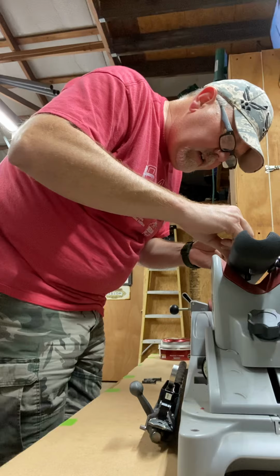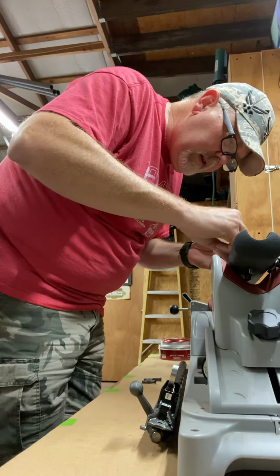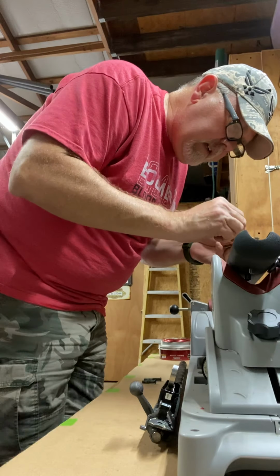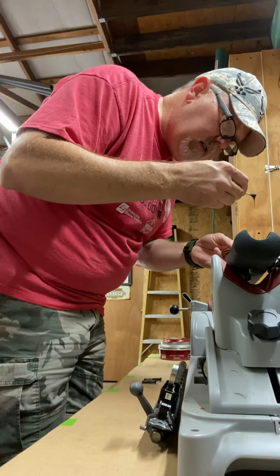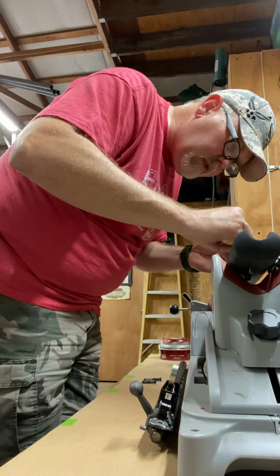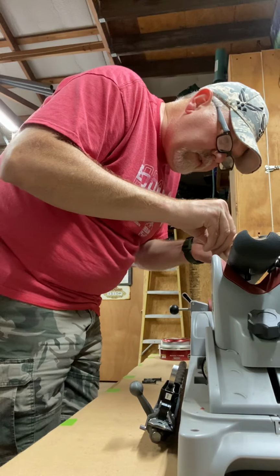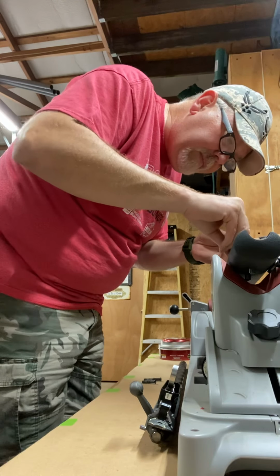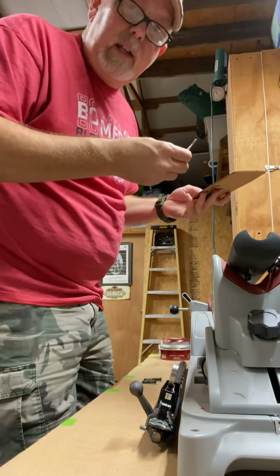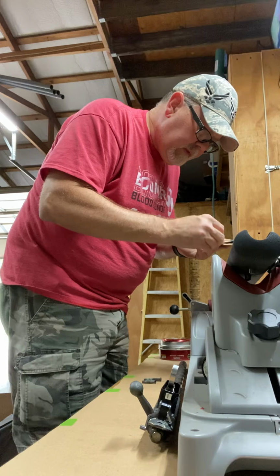And then I'll put a little bit on the aluminum that I showed you in that bedding area. I'll put it on both sides, all the way around the hole. And this turned out a little bit thinner than I expect. I usually have it thicker than this, but I will kind of build it up just a little bit, so it's got room to kind of squeeze and flow on its own. I'll put a little bit more in the lug area just for the same reason. I would much rather it kind of squeeze out, and I'll deal with it later if I have to trim some of it off or whatever, but it gives a good tight seal.